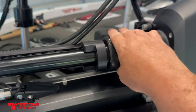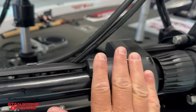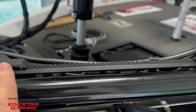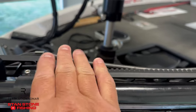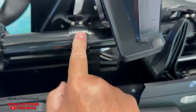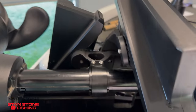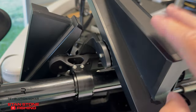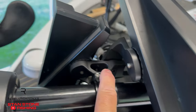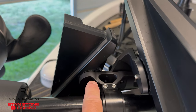Here's the motor assembly. As you can see, it's Cerakoted — everything is Cerakoted, which is the best coating available. Here's the rail — that's what everything mounts to. You've got a centering ring and a centering ring with bushing here. You can get different transducer configurations; I've got the LVS-62 here with a perspective mount, and I've got my LVS-34. Keep in mind, these are zero mounts.